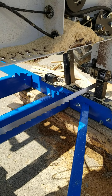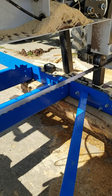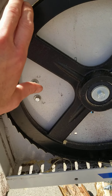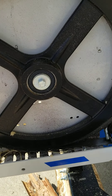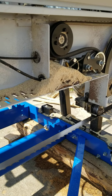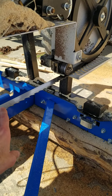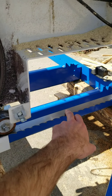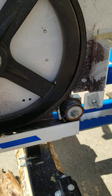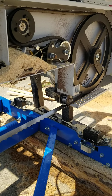What I do is just spritz a little bit of this plant-based oil — it's very thin, almost like the consistency of WD-40, but it doesn't evaporate and it doesn't seem to be very sticky to the sawdust. It really doesn't want to stick to the blade and cause a whole bunch of sawdust to clog up the housing. I spritzed the roller bearing guides right here and over there, put a little bit of oil on the blade, then engaged the clutch and drive belt and let the blade roll through a few RPMs to spin it through the whole system, then commenced to cutting.